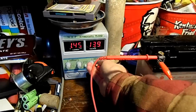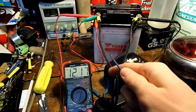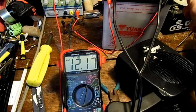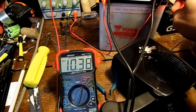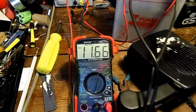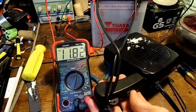It charged up to 12 to 13.8 volts. Now that the battery has finished charging, it's already dropped down to 12.17 volts after about an hour of sitting. Adding the 2.5 amp load, we get to hopefully above 9 volts. Well, that's better than it was before, and it goes back up to about 11.8 volts. But that's not doing too well.